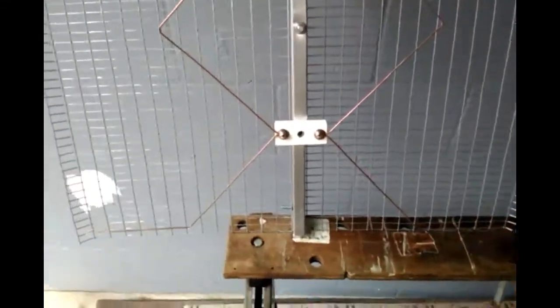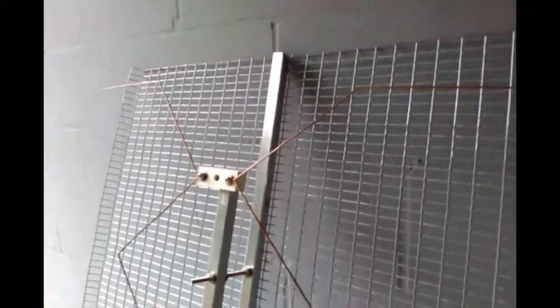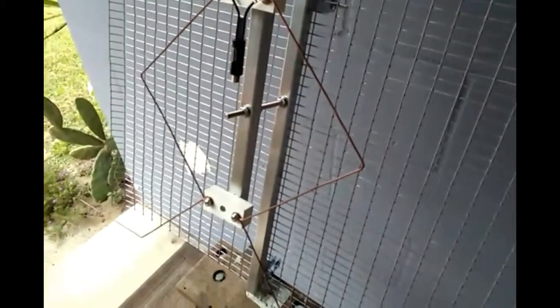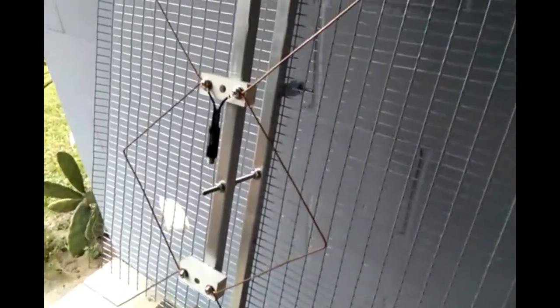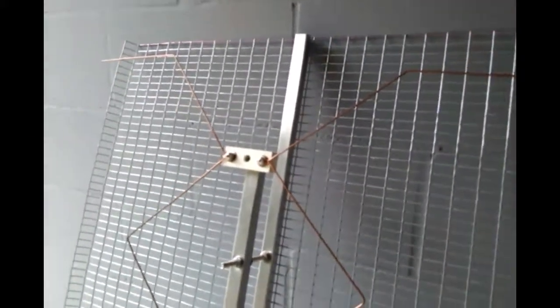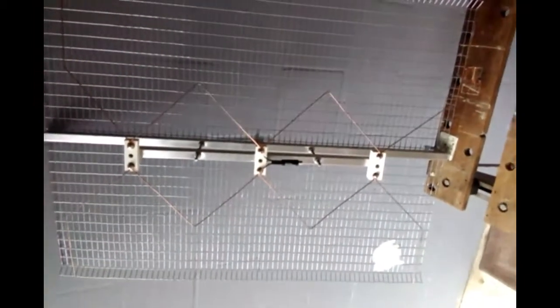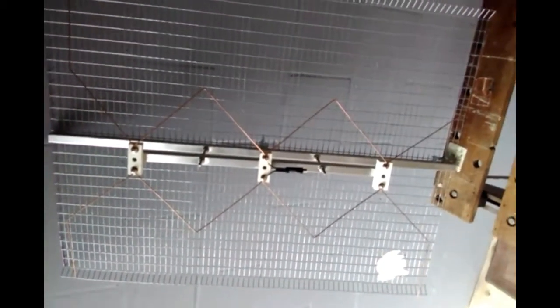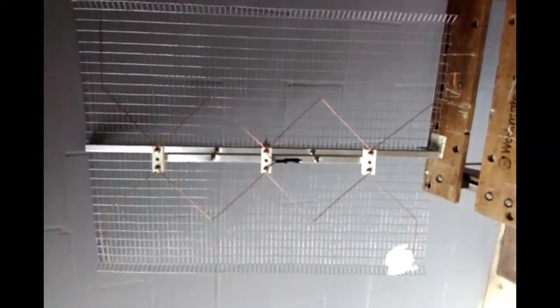Here we go — there's the antenna, finished. Here are those tedious bends I made on the edge. The antenna looks nice, it's adjusted properly, the Balun's adjusted. We went through everything — making the elements, making the backbones, doing the drilling. All told, if I was to start from scratch, it takes me about two hours to build one of these. But I always build in sections — build backbones, build insulators, build elements, and then put them all together one day. It's a fun project, and this is probably the most powerful antenna you can make.